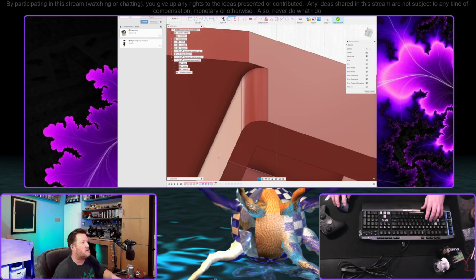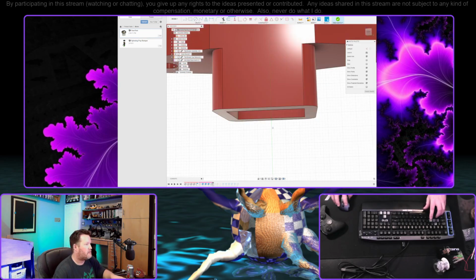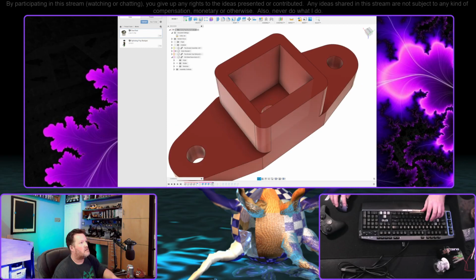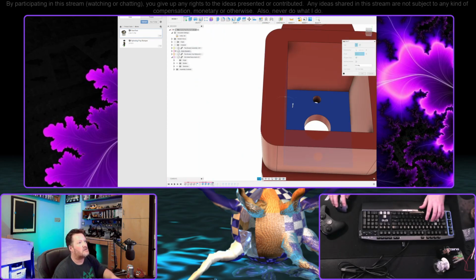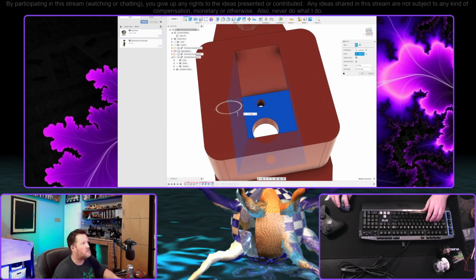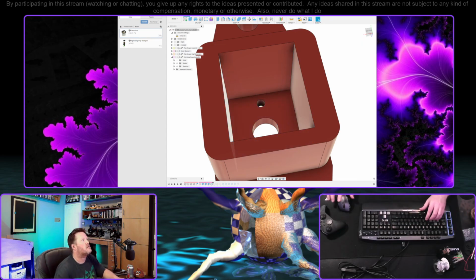And it doesn't even have to be much. It is very tight. Well, I wouldn't say it's very tight. It is snugly tight now. So, yeah, I guess we can just draft these in slightly. Is there a way that we can do that symmetrically? I'm not even certain of that. Will this automatically flip for me since it's got a different normal? Ah, it does. One degree over the whole thing. Let's see how much of a difference that actually makes. Okay, we're 10 millimeters first.